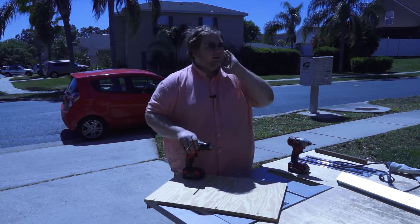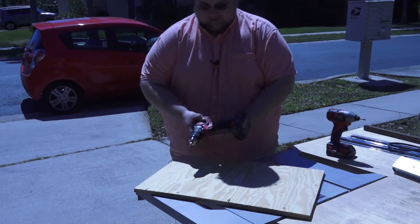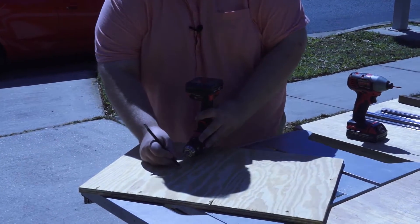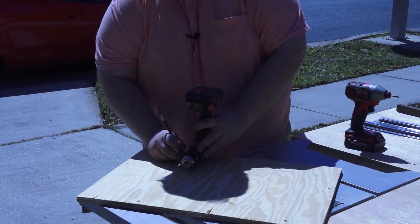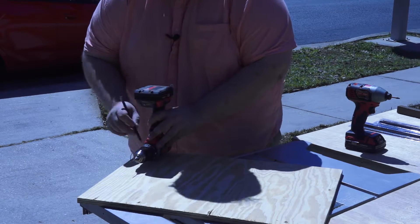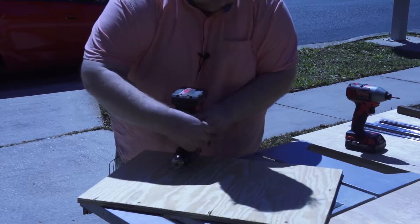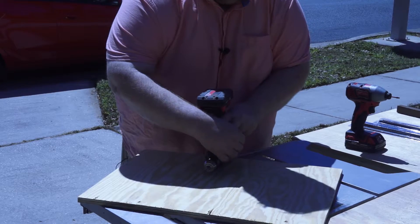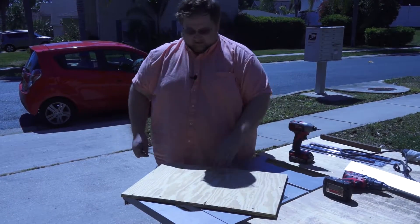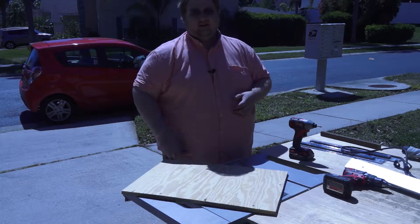Now that we got the French cleat on the wall, we're gonna build some shelves for our different tools — starting with the drills. I'm gonna flip this upside down so the drill sits in kind of like this, so you can easily take it in and out. I'll mark in front of the drill for the cutout for the grip and mark the width of each one — basically tracing the tool. I'm going to do enough for four drills; I only have three right now but you never know when you'll get more. Then I'll rip it into a rectangle on the table saw and go in with a jigsaw to cut out the notches for the handles.